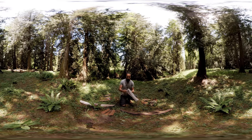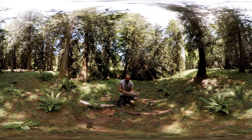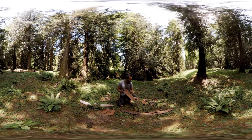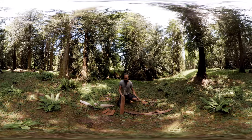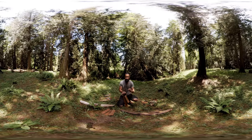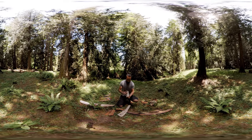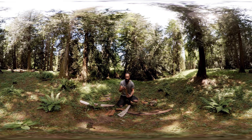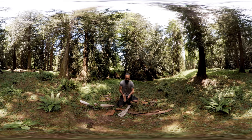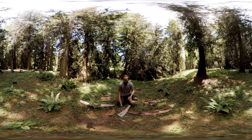What I'm looking for — I want to avoid knots. I want to find the cleanest, straightest grain possible. Avoid any natural cracks that you may see, because what we want to do when we're looking at a piece of wood is find what's fitting inside. Is there a fireboard somewhere in here? Is there a spindle somewhere in here? This is nice straight grain. I don't have any knots on the side. I can't see any cracks going through. There's a little bit at the end but they're terminating about here. There's definitely a spindle and a fireboard somewhere inside there.